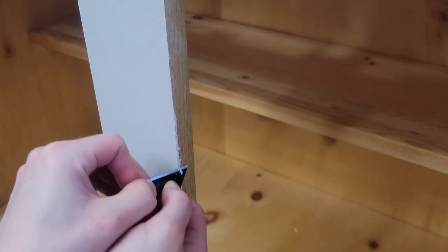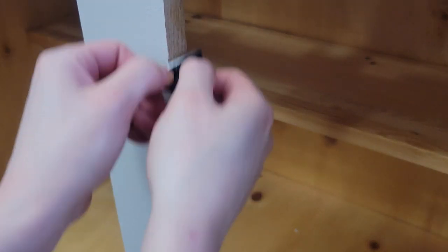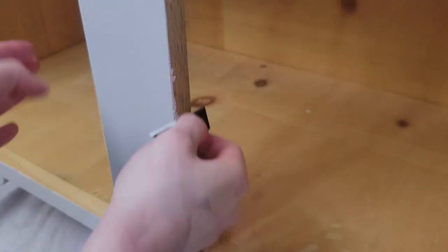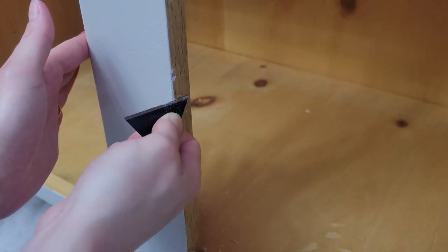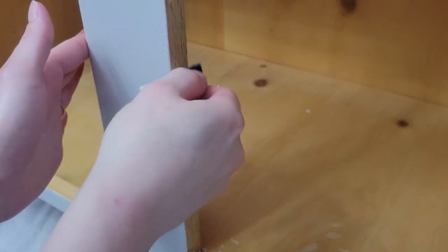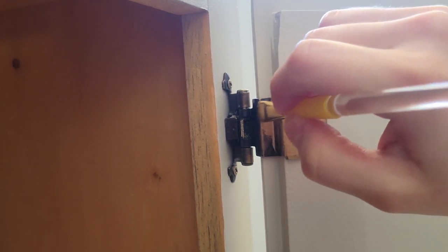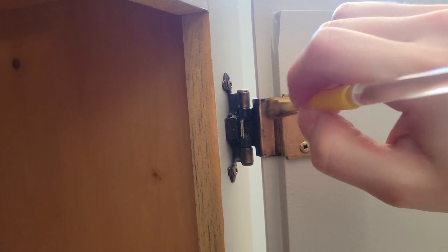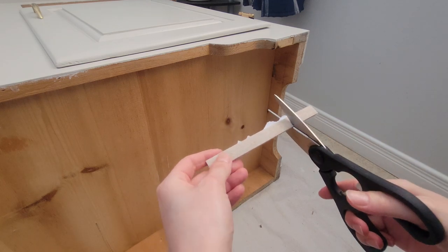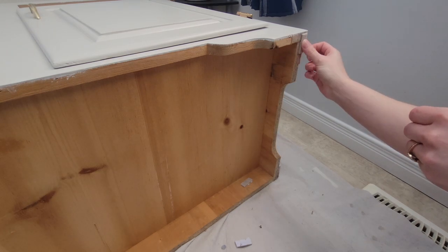I'm just taking a sharp razor blade so that way I can get rid of any of the bleed-through that happened with the primer. If I didn't use tape it would have been far worse, so I know it's a little extra step but I think it's well worth it. I wasn't planning on using gilding wax on the hinges but I decided I might as well — I couldn't get them as clean as I wanted and gilding wax is really great to make them shiny and look brand new. I do always like to put felt pads on the bottom of any piece, especially when you are selling these pieces to somebody else — you don't want it scratching up their floors.